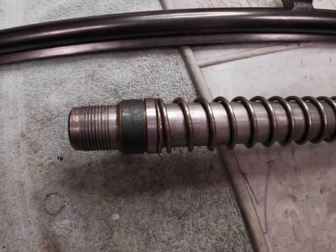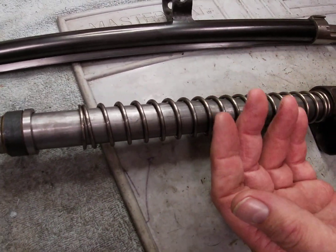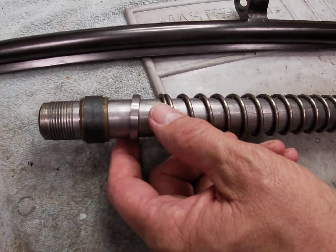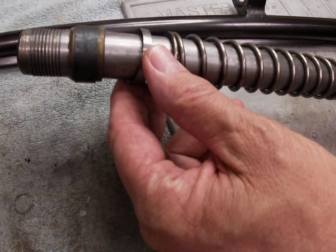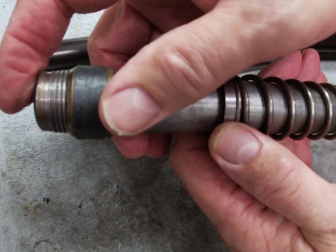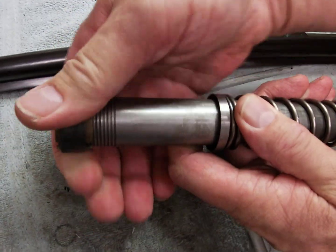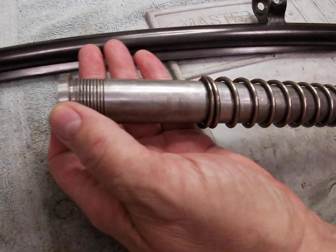The tube here is almost gooey - there's not much lubrication on here to allow correct cycling. Also, this metal band friction ring is in the wrong position for light loads. We're going to remove the bronze friction ring and the metal friction ring.